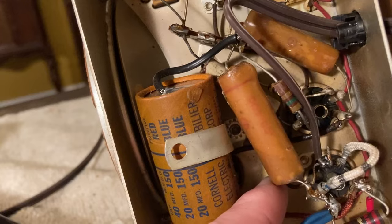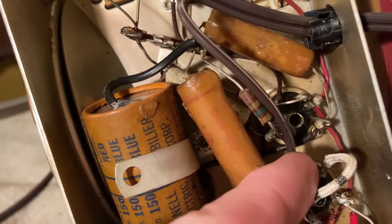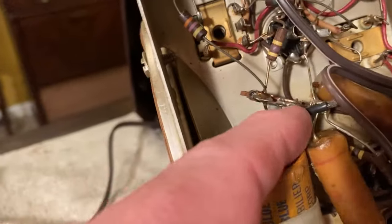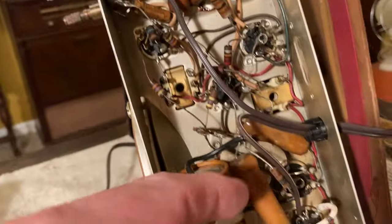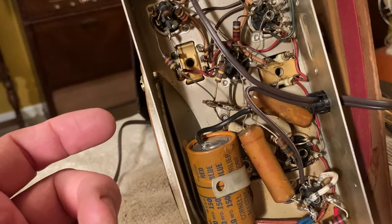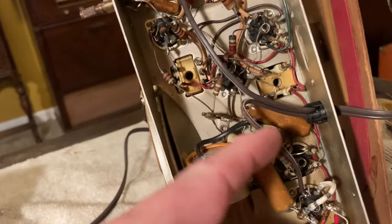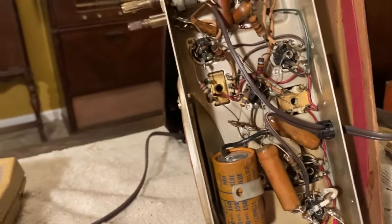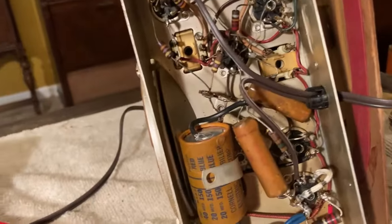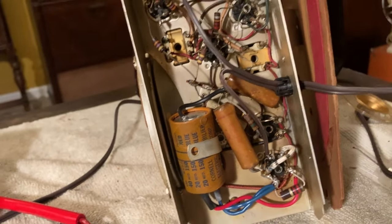I checked them with the multimeter — none of them are shorted at the moment, but as you're all aware, they can short at any time. So I am going to take out the across-the-line cap, which is basically connected from the hot side over to ultimately the ground — this cap is across both sides. It's switched, but still, if we're sitting here and one of the caps decides to short, I don't want it to be the one directly across the AC lines and burn down half of the office. So I'm going to swap that one with a safety cap, and then we'll try to boot it and see if it'll do anything before we do the full cap kit.